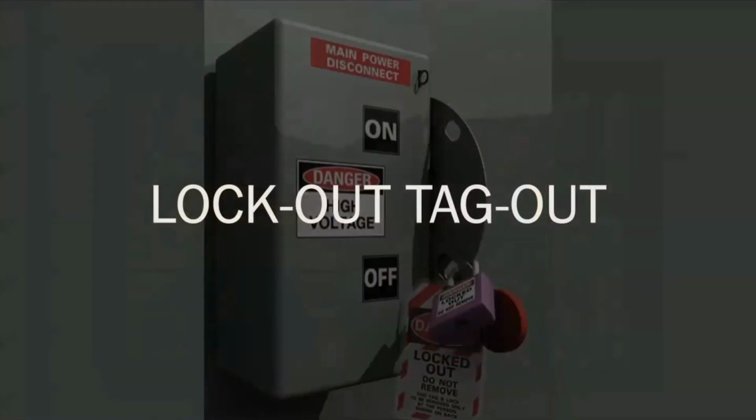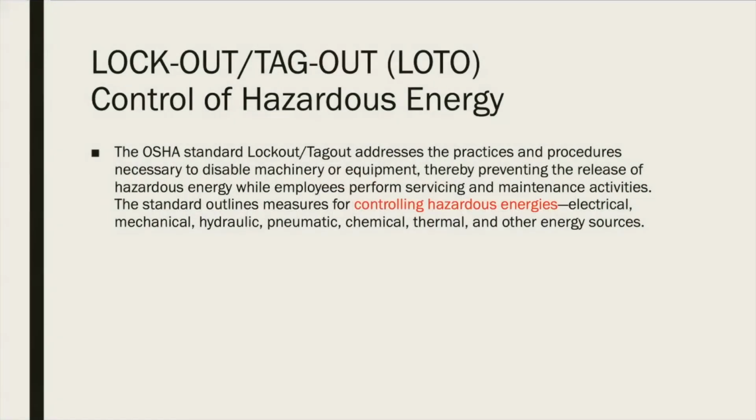Lockout, tag out. The OSHA standard for lockout, tag out addresses the practices and procedures necessary to disable machinery or equipment, thereby preventing the release of hazardous energy while employees perform servicing and maintenance activities. The standard outlines measures for controlling hazardous energies: electrical, mechanical, hydraulic, pneumatic, chemical, thermal, and other energy sources.